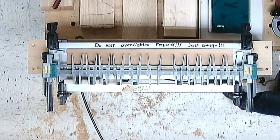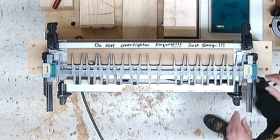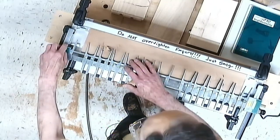Set the scales on the thickness to your tail boards always. So tail board, I know because of milling these boards, the thickness is 3/4 inch. So I'm going to set it at 3/4 inch, using the reference line. There's only one line. If you can, Chris, zero in right here, but there's one reference line on these